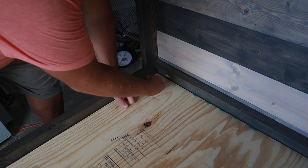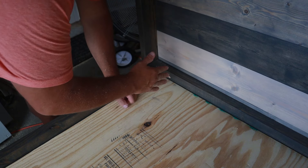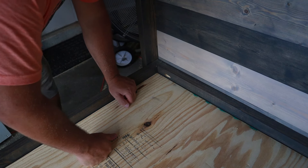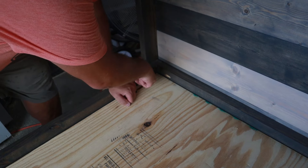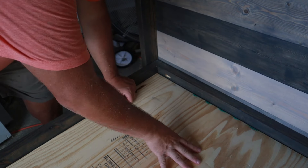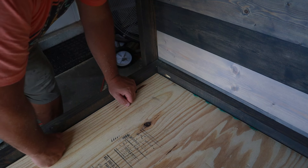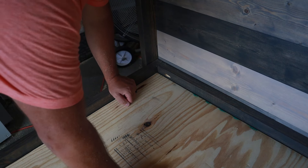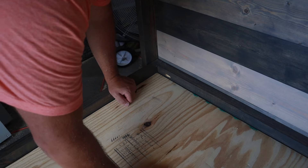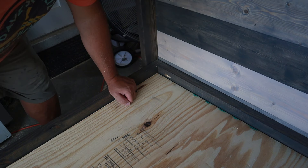The last thing I need to do is screw the side rail to the leg of the headboard — I'm going to do that when I get it in place in my son's bedroom. I'll also throw a few screws down through this plywood mattress support to screw it down to that piece of one-by-two inside the frame. That will help stabilize it so it won't move as much — it's not really a structural thing, just to prevent any bouncing if something is warped a little bit. Other than that, this is done.